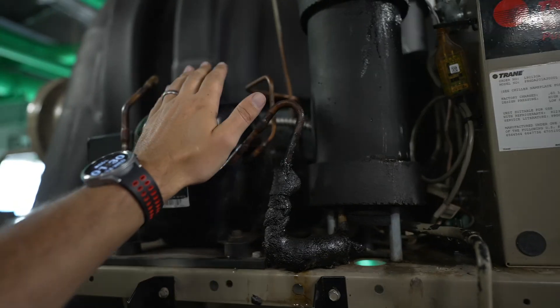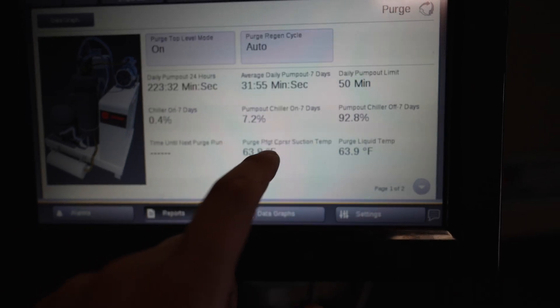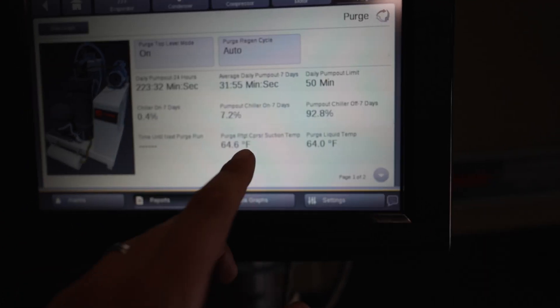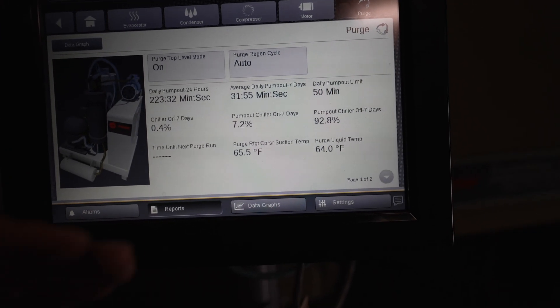The question became: is this even functioning properly? This unit takes 0.6 pounds of 404A — thankfully the customer had some on site. When you run into a scenario like this, it can sometimes make more sense to just start from scratch. It's questionable, it's just over half a pound of total charge, so we pulled the charge out, pulled the vacuum down on the circuit, and put fresh refrigerant back in. Since doing that, our suction line is now consistently running down into the freezing point, fluctuating between about 40 to 60 degrees on the upswing and then dropping into the negatives fairly rapidly.